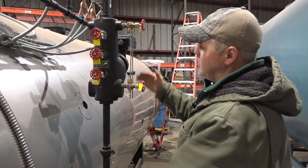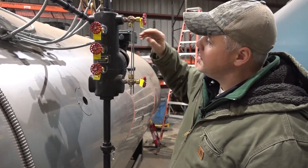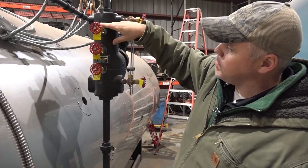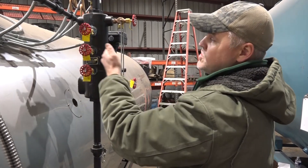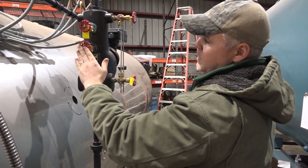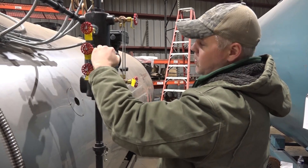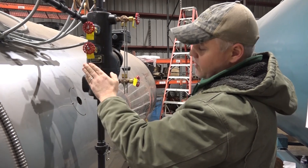With that you have the visual indicator when your water column or your sight glass is installed, but these three valves — on this top one, when you crack this open you would have a steam release from it, whereas this one there should be a mixture because this is your water line area, and so you'll get a sputter from this one.